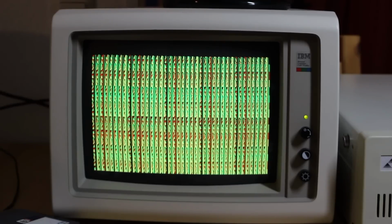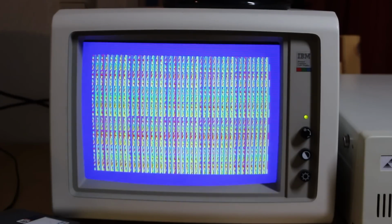In order to try and narrow the problem down a little bit, I wrote a program to just put a pattern into CGA memory, and it seems to be correct. I've compared this with another machine. So it's not just putting data into the CGA card that's the issue. Maybe it's the background color that I was using in my demo. So I changed the background color here and redrew the pattern, and it still looks exactly right. So that's not the issue.